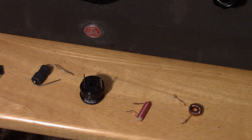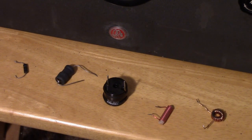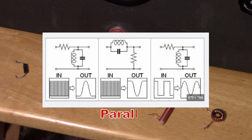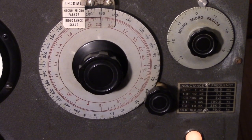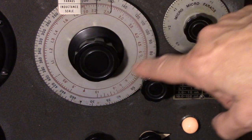Often times we want to actually measure the inductance of coils, and the Boonton Q-meter can do that. You can use a formula — once you resonate the coil with the capacitor — to determine the resonance, much like using a known capacitor on a resonator with a generator and scope, then using the resonance frequency formula backwards to work out the L. But as an added convenience, we have a little guide on the front of the meter, with a separate scale in red for inductance, which is really interesting.